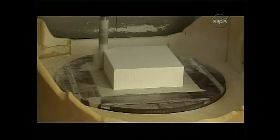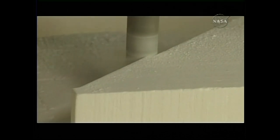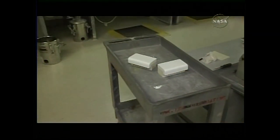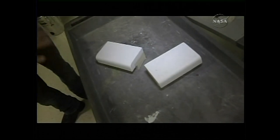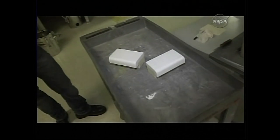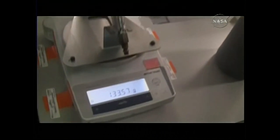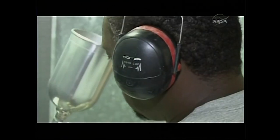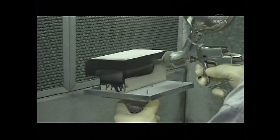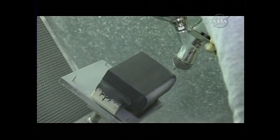In the beginning, we take a series of rough cuts to remove the bulk of the material, then a series of smaller, finer tools come in to refine those surfaces. The next step is to apply a series of ceramic coatings. The materials at this point don't have a lot of strength, so we put on a coating — either black or white, depending on the emittance properties required. It's applied in several layers, sprayed by hand, with a very exacting process of weights and measures to ensure the coating is the exact correct thickness.